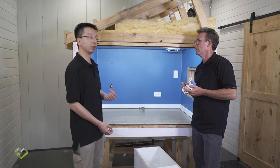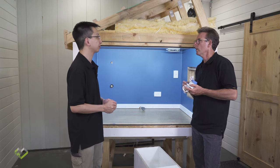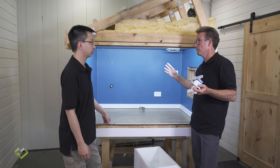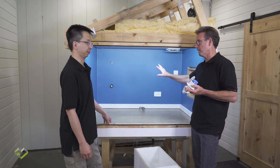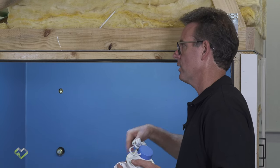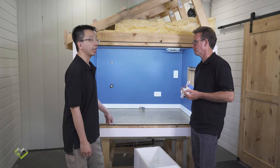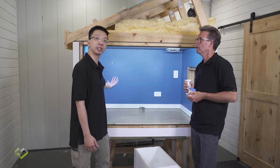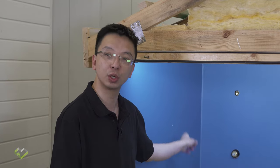What we recommend you to do is to use caulking mastic to seal between the pipe and the plasterboard, then you can use the traditional approach to make it look good. We're not relying on tiling — for example in a shower recess. It's got to be done at the plasterboard level, the mastic, the caulking. And if you have to do a waterproof membrane behind your tiling, that should be the point where you also do your air seal.